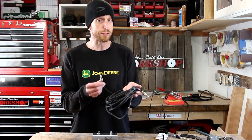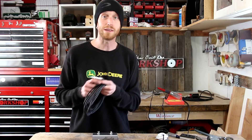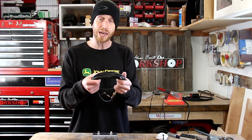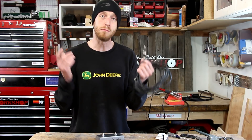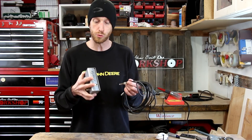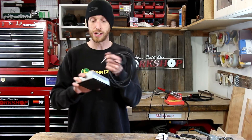I just like being able to replace individual components and pieces. Almost every single guitar effects pedal has jacks where you plug in your cables - they don't come with cables already attached, so you can string things together, and I look at this the same way. Probably the last reason I like having them separate: I think in most towns it's going to be a lot easier to go find an individual instrument cable than to try to find a whole replacement footswitch if you needed something last minute because yours broke and you had to perform.